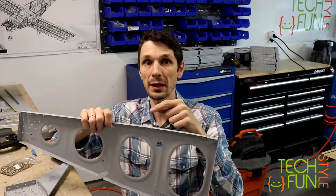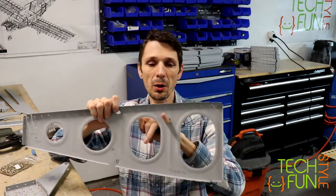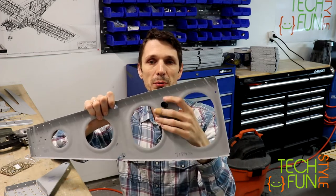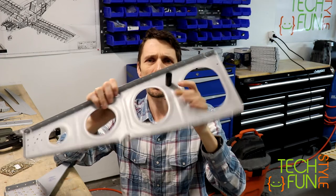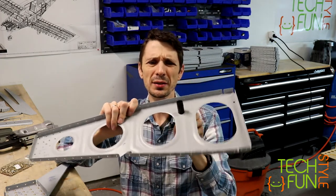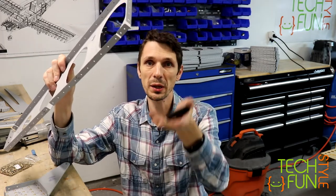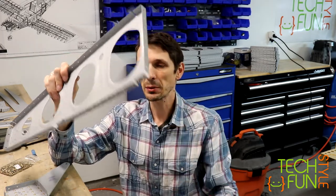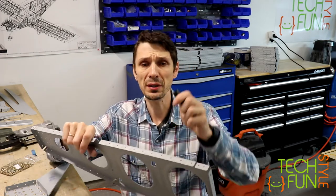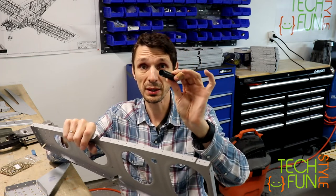And the second hole, the one which will go through all the wings, the other hole for the pitot will be only in the left wing and only for the first 10 ribs. While this bigger hole is for the plastic hose, for the plastic pipe. It's going to be a long pipe. It's half inch external, and internal is almost half inch. It's very light, super light plastic pipe. I was investigating PVC pipe, but finally I came up with this very light and robust plastic pipe.